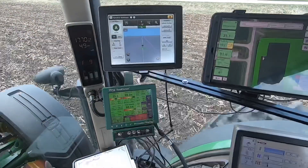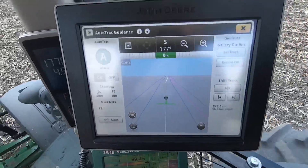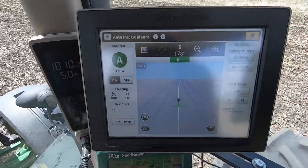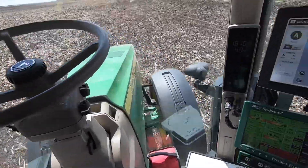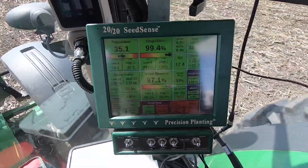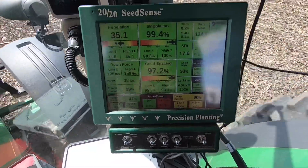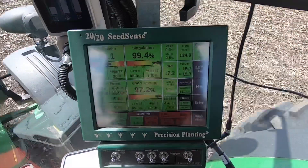Let me give you a quick rundown of all these screens in the cab right now. This is the John Deere display, it's a 4640 model - the same screen I had mounted on the Gator last week when I was driving around mapping the waterways and borders around the edges of the field. Right now we're using it for auto guidance - it has the line set up and it's driving the tractor so I don't have to guess where to drive. Next up is the Precision Planting 2020 monitor, which is actually controlling the planter. I've loaded the maps of the waterways and field boundaries into this monitor, and it's telling the rows when to shut off and when to turn on based on entering and exiting waterways and overlapping areas that we've already planted.